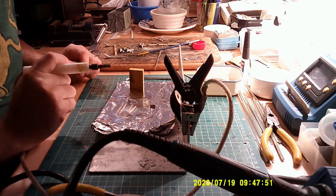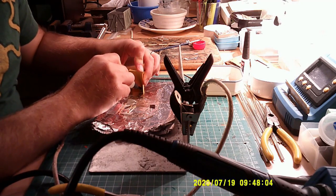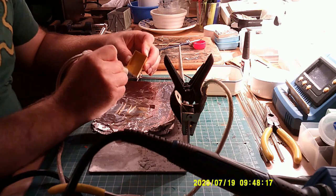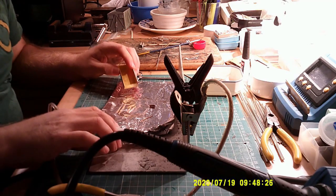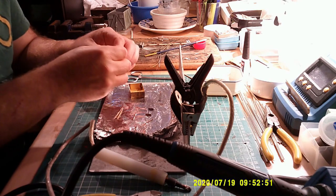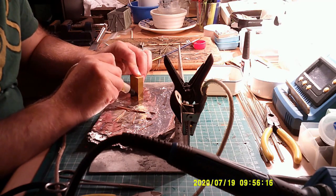We've tinned up all the parts. We now need to tack the corner plates in place. The first ones to be done are those which don't have the corner plates in them, so I've put some solder flux in there and about five millimetres of solder, and I'm going to use the resistance solder machine. Now we take the bottom strapping piece — that needs a little bit of trimming — so we've got the bottom piece of strapping in place and give it a quick blast with the resistance solder machine, then go to the ends and do exactly the same.